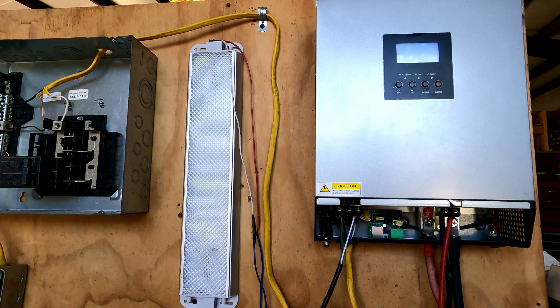It's a 3KW DC 24-volt, 50-amp maximum solar charge current, 2400-watt rated power, 80 VDC maximum PV input, and it is pure sine wave. This thing is actually a hybrid solar inverter — DC 24-volt to AC 110-volt — with a built-in 50-amp PWM solar controller.